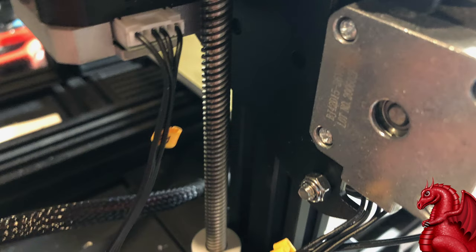Now, before we get into the various fixes for Z-axis binding, I want you to take a look at your Z-axis screw. The simplest and most common cause of problems with the screw is that the screw itself is dirty. If it's properly lubricated, you're going to attract dust and dirt and small bits of filament on it. And these can build up and cause binding. So before we get into any of the other fixes I'm going to talk about in this video, take a look at your screw. Make sure there's no dirt or debris in it. And if there is, just clean it off with an old toothbrush and apply a little more lubrication